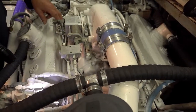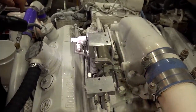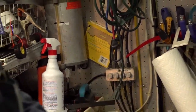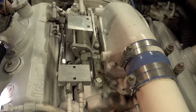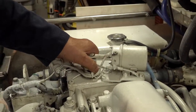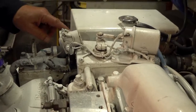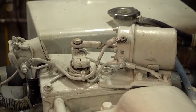We have throttle controls — all controls are Hi-Nautic. Up on the bridge you have your Hi-Nautic controls, fed by this block right here. You have two stations and four connections. When you advance the throttle from up above, this comes back and opens the throttle. When you stop the engine with the stop lever, this shuts the fuel off — it's an electric stop solenoid using a relay. Be careful around here; this is hot. When it's energized, it comes through to here and turns on the solenoid, which shuts down the fuel and shuts the engine off.